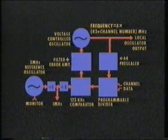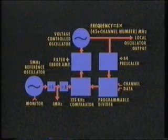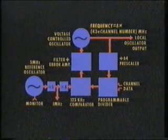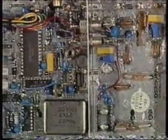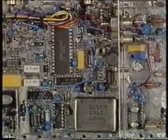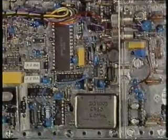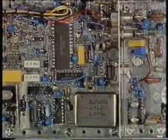This is exactly how the output oscillator works, although in practice there are two VCOs, one for the high and one for the low channels. The VCO in use is determined, as is the programmable divider ratio, by the setting of links on the personality panel. Looking at the actual unit, we can see one of the voltage-controlled oscillators on the right. The reference oscillator in its oven is clearly visible, and above it, the large IC contains the main loop programmable dividers and the phase comparators.